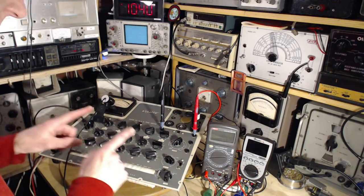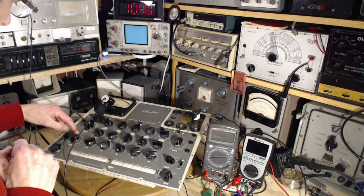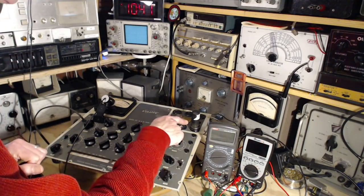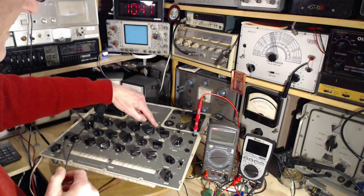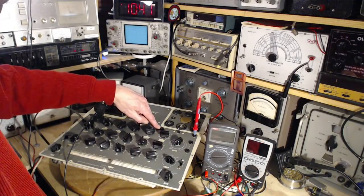I think we're all set here. Now the first thing we're doing is just the EM test. So I can switch this on now. I set the line. The bias is set this way - we don't set it by the meter, we just set it by the dial. I still have this ammeter hooked up. It will reflect the current flow into the filament of a tube in this socket. And this guy is going to be reading the current flow between these two terminals. I'm going to leave the positive one in here so I don't make a mistake.